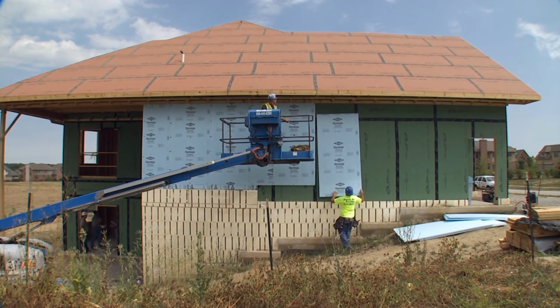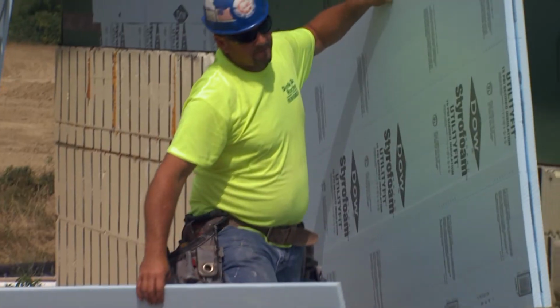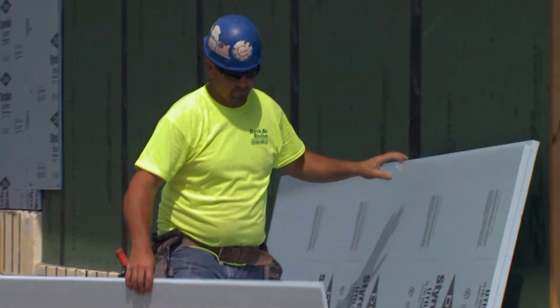So if we go back to the wall that I talked about earlier, that perfect wall, everything's on the outside. So if the insulation gets wet, it doesn't care because it's designed to take it. If it's mineral wool or plastic or whatever it is, it doesn't care if it's wet or not. It may perform a little bit less if it's wet, but it really doesn't care. Everything on the inside is protected because you have that water control layer there, that membrane that's protecting it.